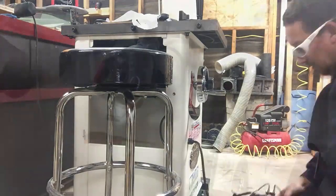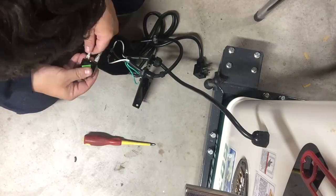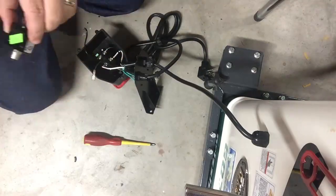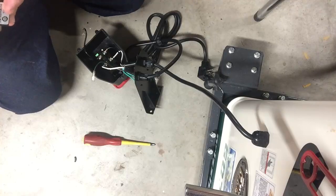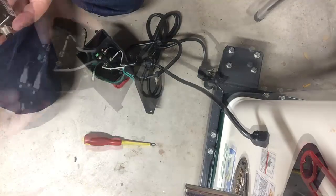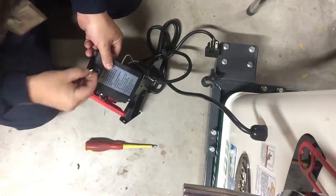You're going to slip off the two black wires, but before you do, note that on the breaker they're marked "load" and "line" — make sure you take note of which wire goes to which one. Then put the breaker back in the box, put the nut back on to secure it, and put the back back on.